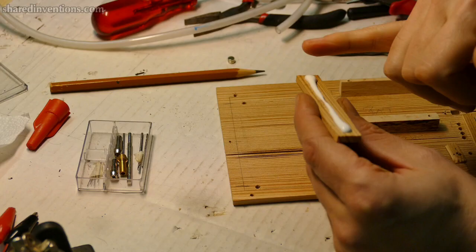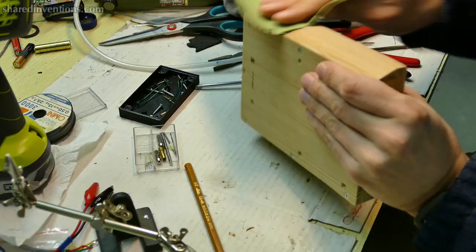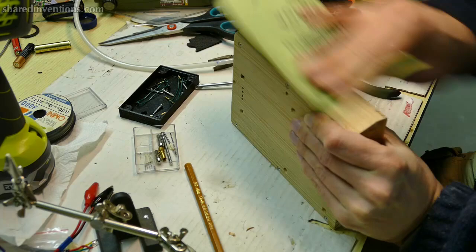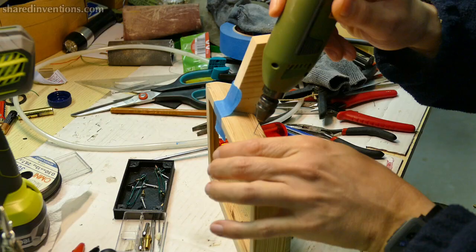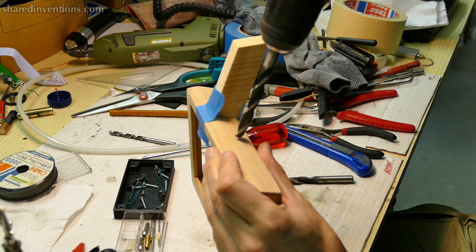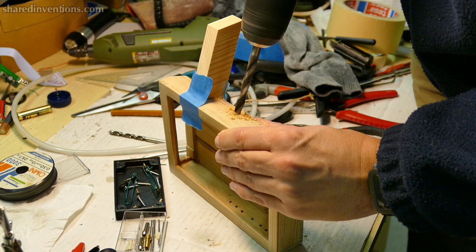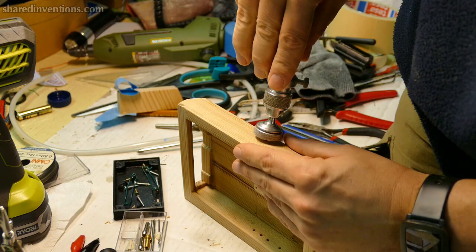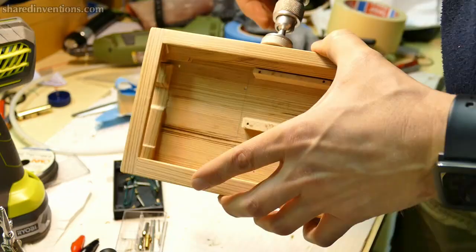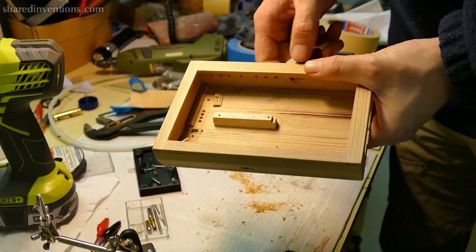I realized that the backer board is likely to curve, so I attached extra pieces here and there. Sanding everything smooth. Oh, I nearly forgot to attach the tripod-accepting nut — I pre-drilled the hole, then grabbed a bigger drill bit for the indentation, then made the final cut for the threads. The threads for the insert were cut by the insert itself. I used a monopod to drive in the insert, and repeated the same process for the top mount nut.